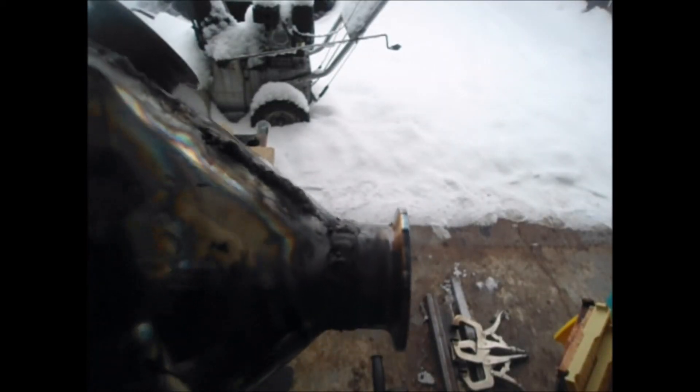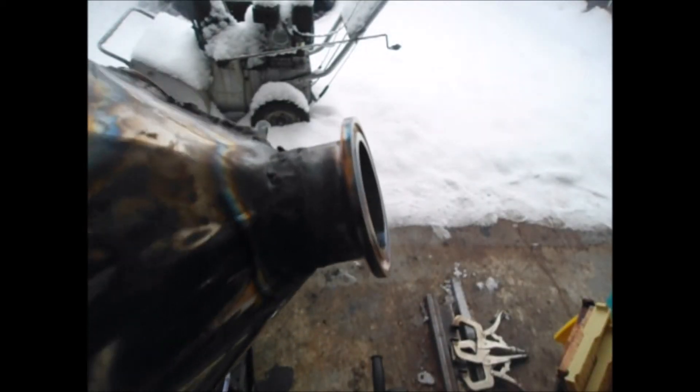So here's the result. You can see there's a couple spots where I burnt through — there and there. I'll have to go put on the aught tip. I have the number one tip on right now, but you want less heat when you're dealing with that thin sheet steel from just the regular pans and pots.